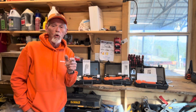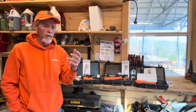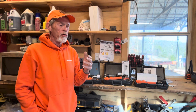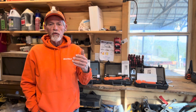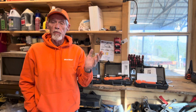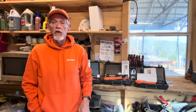Today I want to go through something very important. It's not touched on a whole lot, and when I was doing the research I didn't see enough of this. If you are going to be purchasing hardwood lumber from a local lumber mill and they're proposing that their wood is kiln dried, one of the key things you need to do is let them show you. Have them break out their meter — you want this piece of wood kiln dried — show the meter, get the reading, and make sure that it's kiln dried.